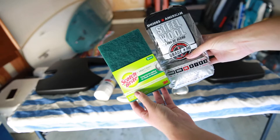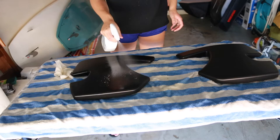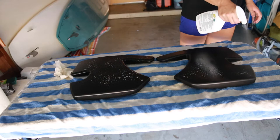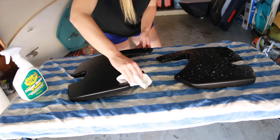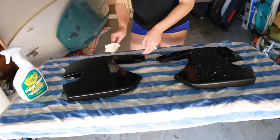The first thing you want to do is prep the surface with Crud Cutter — spray it, wipe it all around with a rag, and then leave it to dry. This removes any coating that is on the plastic. People use this stuff when they repaint their kitchen cabinets because it cleans off grease and also removes the coating so that paint can adhere. It's kind of like a liquid sander.